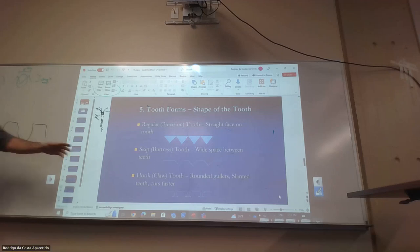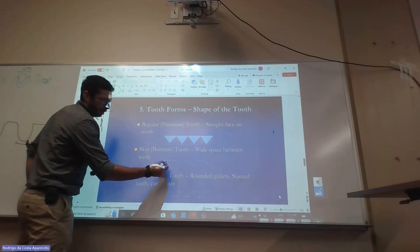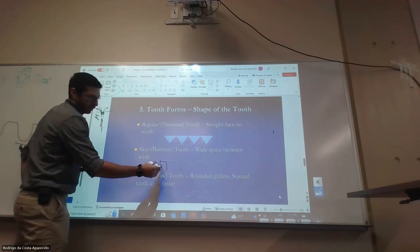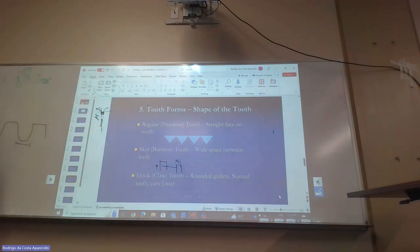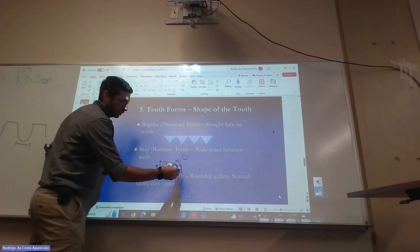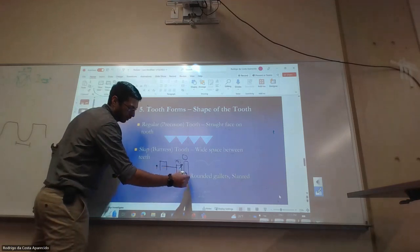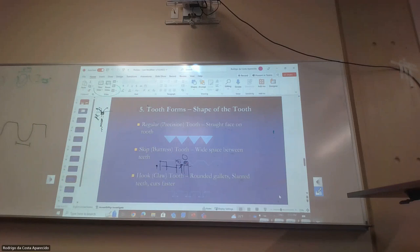So for example, if I'm cutting something with these teeth here, imagine that my piece is this big. When I come in here, I'm going to lose this much, right? Because I have this gap here, I allow it to actually drop. And then the next one is going to take that much again. That's when I can actually take a lot of material. So I don't mind taking a good chunk of material at a time, right?